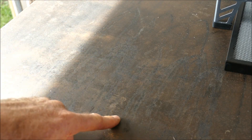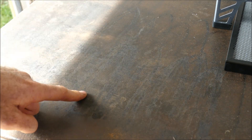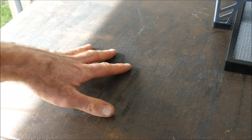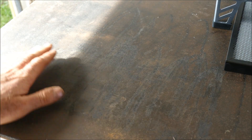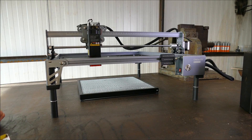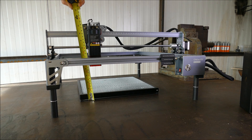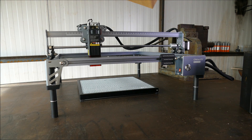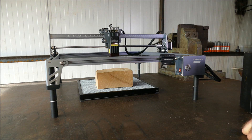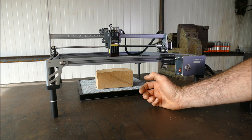To illustrate the point, I've got a steel working table, but you can see the laser has engraved shapes and stuff onto it. Not only that, you've got all the tars and resins from the wood kind of billowing out and sticking to my table. So it's good to keep your surface clean and that honeycomb will come in handy. With the extended height, we have an extra 135 millimeters or five and a quarter inches. That's going to enable me to have much thicker pieces of wood, and we can actually put a rotating y-axis on for engraving bottles or mugs.